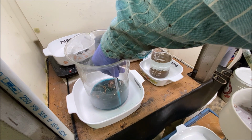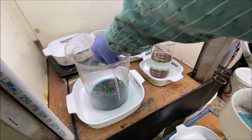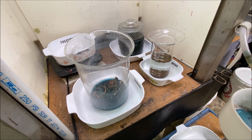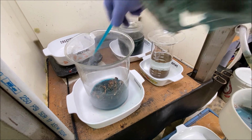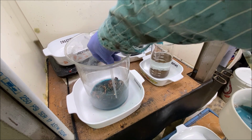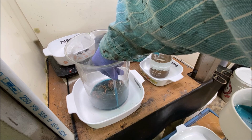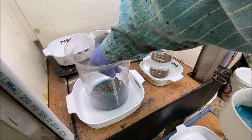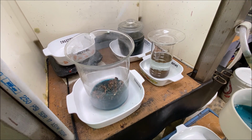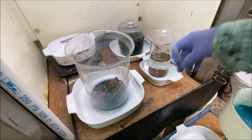And what I've done is I started on some gold-filled stuff here. I've treated this with nitric acid, and I'm pulling that off now and filtering out this solution. This is gold-filled material that's had the base metals removed with hot dilute nitric acid boils. It's going to have a little bit of silver in it, but I'm not quite done with that. I've got to add some more nitric acid in here and make sure I've got all of the base metals removed before I proceed. And back over here, I've got about an ounce of gold that I refined, some carat scrap, and I did this all off camera